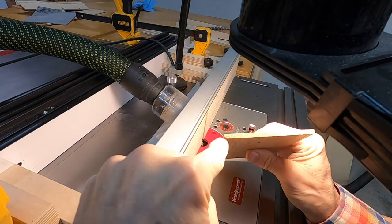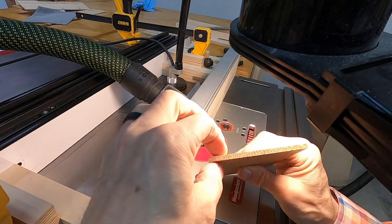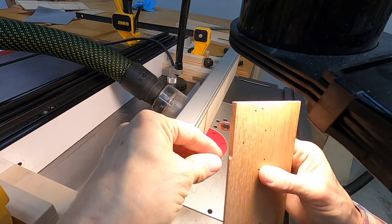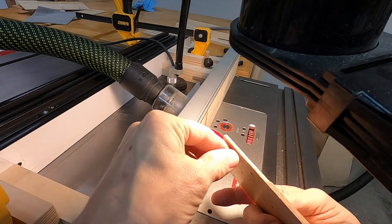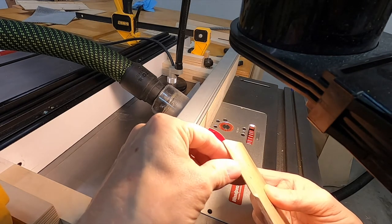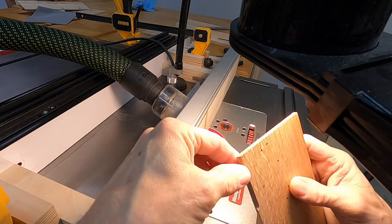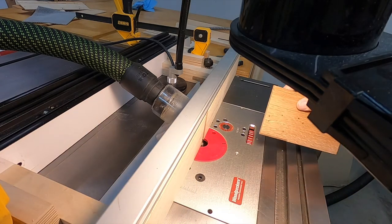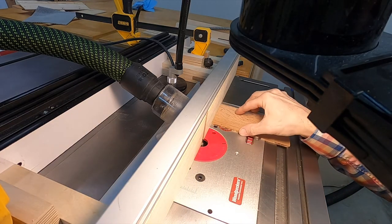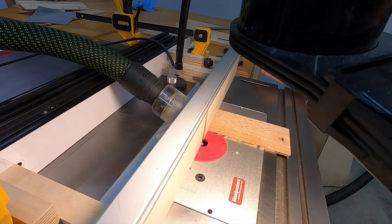You can see the chamfer, you can see a slight little facet on that edge, and this is about the same thickness as the spalted top. So I've got this little chamfered edge right there with a nice little flat showing up right there. You can see the shadow of the flat right there. Now you can see the shadow of the chamfer. And so that's the shape, and we're gonna do that all the way around. So what I'm gonna do now is test to see if I can go end grain across this thing and not cause any problems. So here goes.